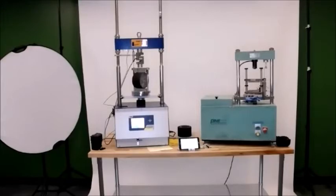And that was one of the comments: part of the balanced mix design is you have to run a wheel tracker. Wheel tracker, you cannot do it on 100 millimeter, no how, no way. So that was part of the comments. If we've got to do balanced mix design, we have to have 150 millimeter samples. Let's just jump in the water. Let's not just dangle our toes in the water. Is that fair, Michael?